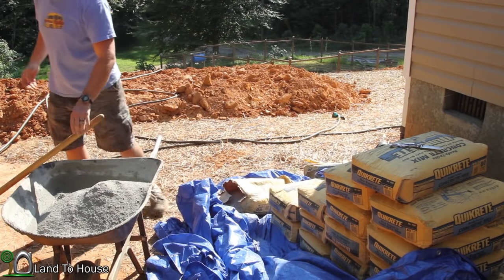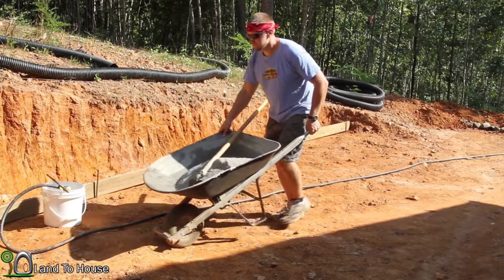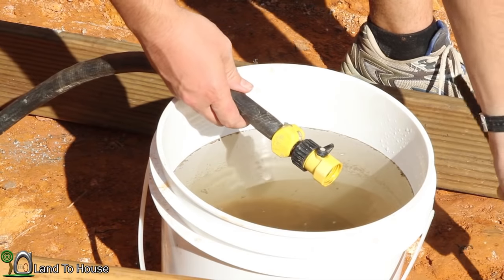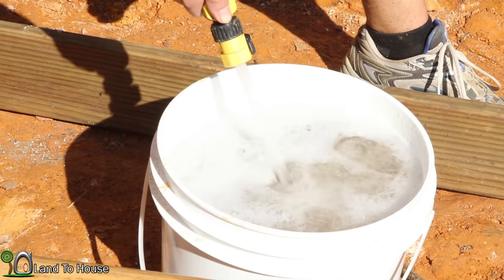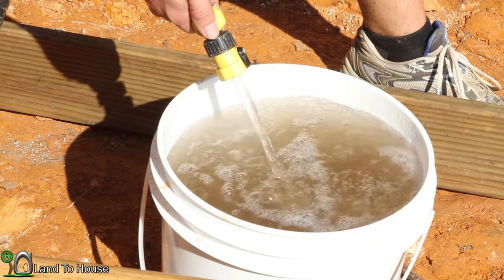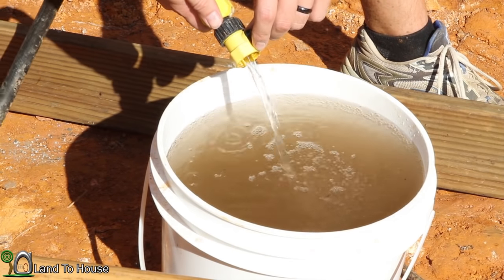All right, we'll move over here to the water. I've had the ram pump water cut off for a little while. Check out the pressure that's behind this thing. Impressive, huh? I'm not sure if that's about 20 psi or what it is, but it's up there pretty good.